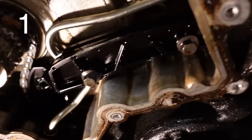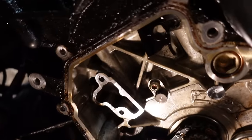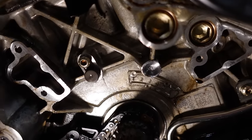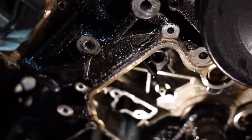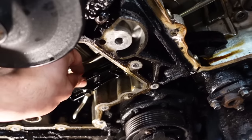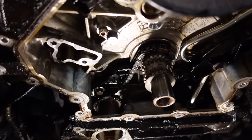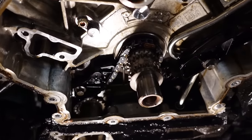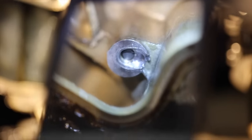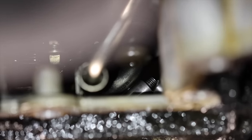Take a look at this guide — one bolt, two bolts, three bolts. Now look at the broken guide: there's a bolt there, there's supposed to be a bolt in the middle, and another one there as well. Look at how much this thing moves around — how loose it is. That is absolutely crazy; no wonder this thing was having issues. The one on the other side is a little loose but not too bad. This middle bolt must have come loose and fallen down there — that could have been catastrophic if it fell into moving parts. Looking with the inspection mirror, I can actually see that a bolt broke off as well — there it is down there.